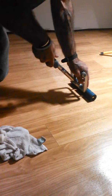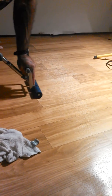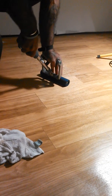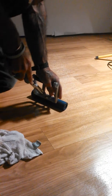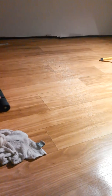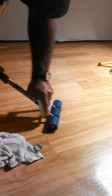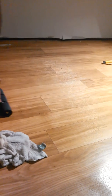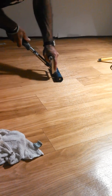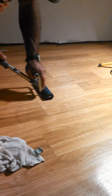If you're ever putting a vinyl floor in and you're having problems with it sticking, or if you've got a vinyl floor that's got bubbles in it that don't want to come out — put a few holes in it, let the air come out, and shoot some glue under it with a syringe. And there you go.